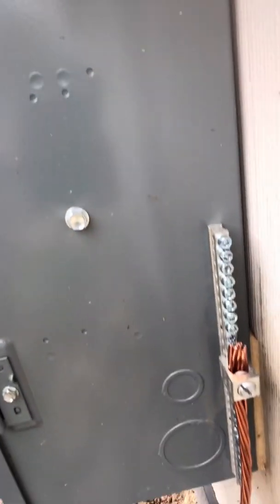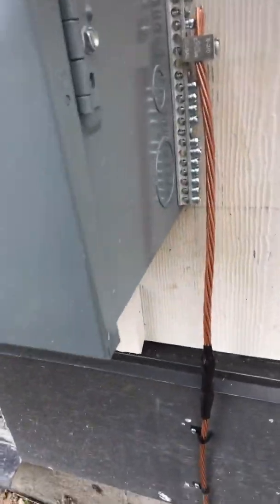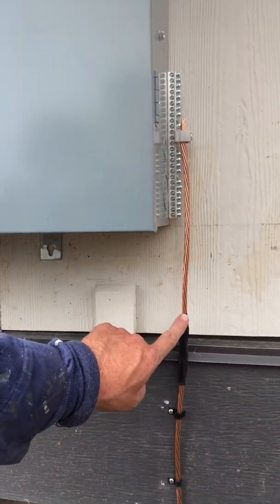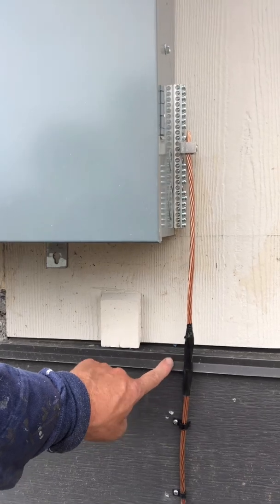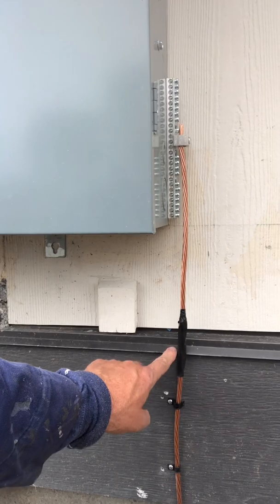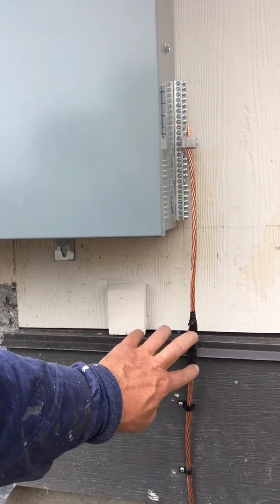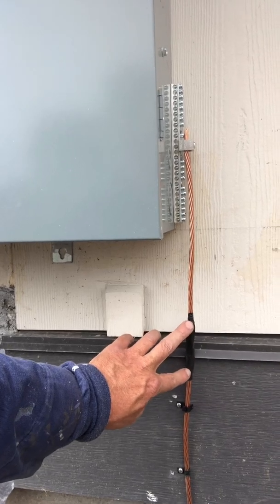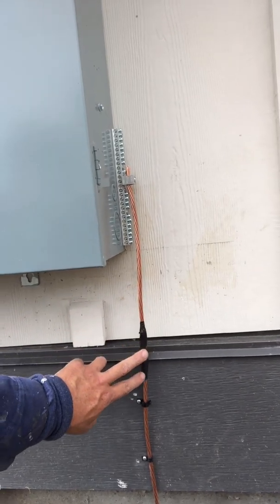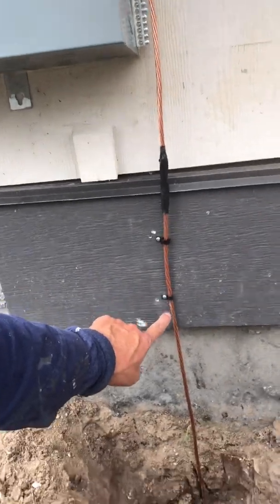The wire goes in here. We also have some trim nearby — if electrical current traveled down here it would go into this aluminum flashing, and we don't want that. So we put some rubber covering over just this section. They want the wire to be bare as much as possible, so we had to make an accommodation for that area.